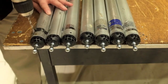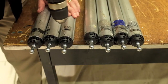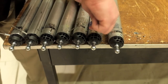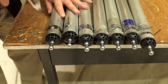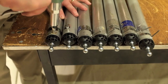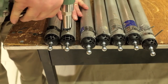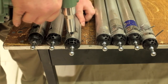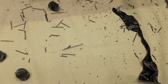Now we're going to use the existing rivet hole and take that number 10 drill bit to drill through the center wall of the ball cap — this is a heavy plastic wall. That'll give us a place to seat our one-inch multi-grip rivets. Make sure the rivet is fully inserted and use your rivet gun to seat the rivet. You can use a manual riveter for this operation as well. Once this is completed, it's time to clean up the mess — now you see why we use a drop cloth. The hotel will really appreciate the fact that you can simply fold up the drop cloth and carry the mess away.